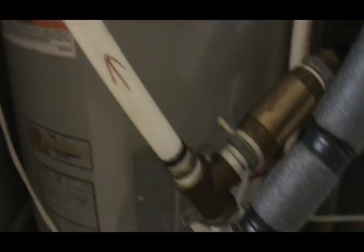I have a check valve here, flow indicated by arrow, and here, to keep things going in the right direction and to prevent the hot from mixing with cold when there's a pressure differential — when taps are opened and such.